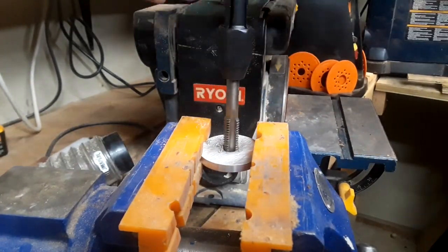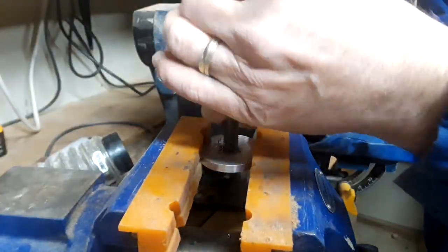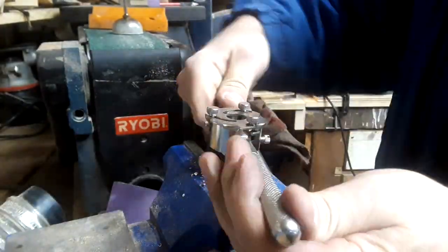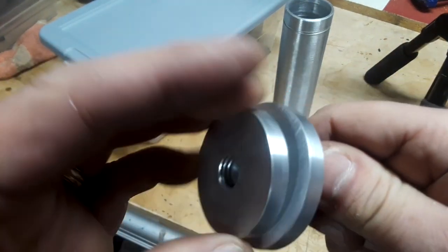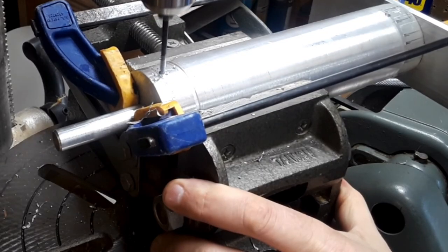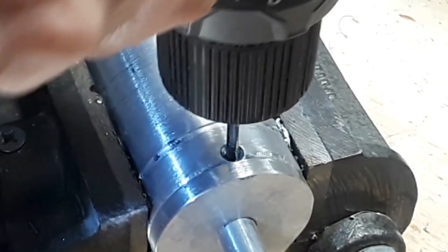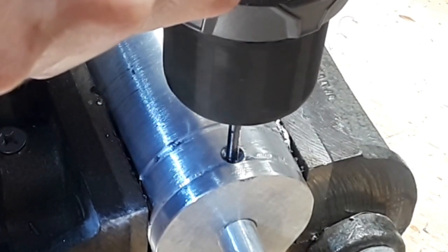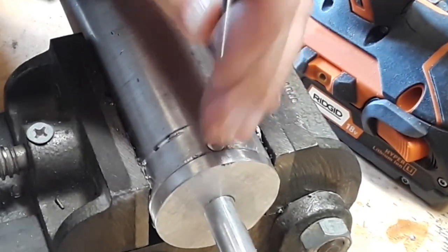They're turned to the proper diameter and the 3/8 inch holes are enlarged to 1 inch holes and threaded. A length of 1 inch aluminum rod also gets threads and is screwed into the two plates. This helps join the plates together, but more importantly its smaller diameter is for making tighter bends. Holes are drilled in from the side of the pipe and into the edge of the smaller disc and then threaded to hold the top assembly into place. I'm not welding it because I don't have a welder — I could have listened to my wife and gotten that TIG welder, but then I woke up.